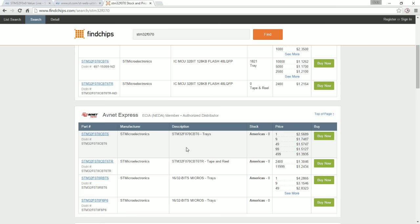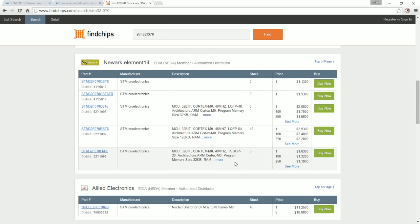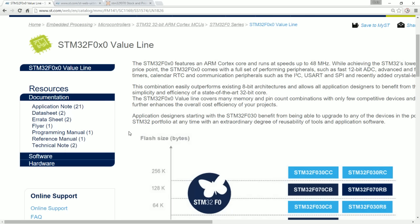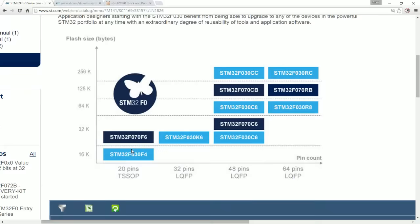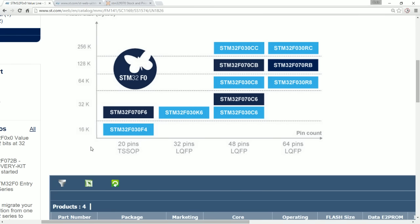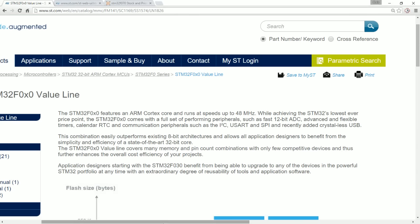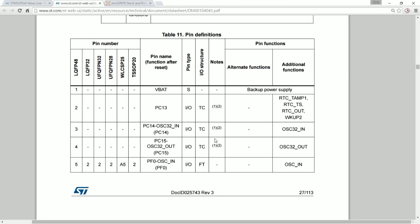The parts big enough to have enough pins are a little more expensive. Is this USB acting as serial or mass storage? The one I built used USB mass storage — it acted as a HID mass storage device, and I just mapped the flash space so that when you drag a file in it writes it straight through. I don't think USB will be as big a deal for us since we'll be in reprogramming mode, but if we had five boards needing five separate images it could get tricky.